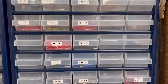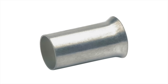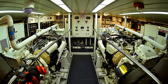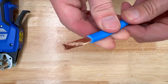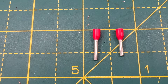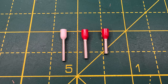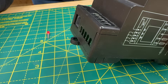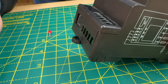Ferrules come in a wide range of sizes, from tiny 0.14mm² options for signal wires, to massive 240mm² ferrules for flexible power cables — ideal if you're wiring up something like a cruise ship. They're designed to match standard electrical conductor sizes such as 0.5mm², 2.5mm², and 16mm². You'll also find different pin lengths, also known as barrel lengths. For instance, a 2.5mm² ferrule is available with 6, 8, 10, or 12mm pin lengths, meaning you can choose the perfect size for the depth of your terminals or connections buried within housings.